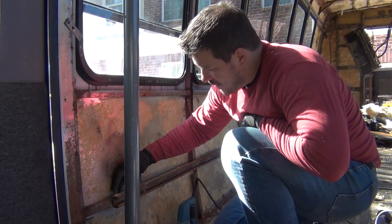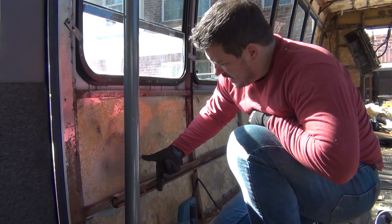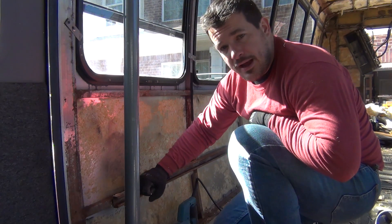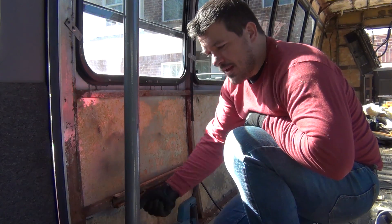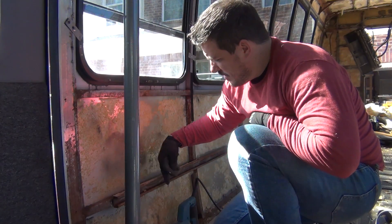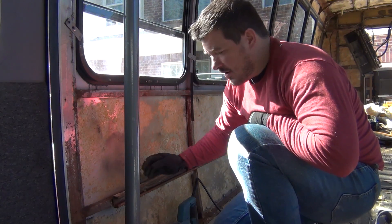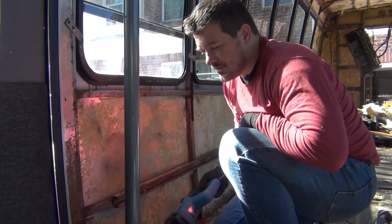I was able to cut off two welds, and now I'm going to cut this with my Sawzall. Hopefully I can pry down on that other weld that's down here and not actually have to cut it — just weaken it by continuing to move it and break it off. If that works, I can cut with my Sawzall every foot, cut the top welds, then pry it down and break the bottom welds loose.